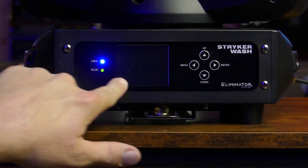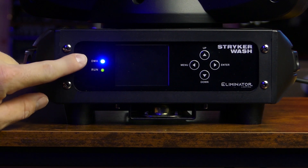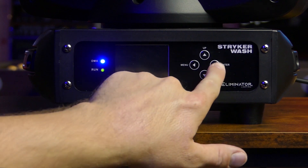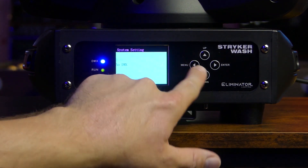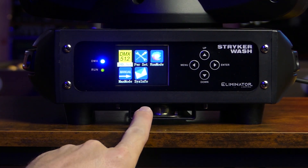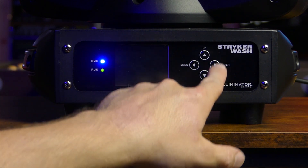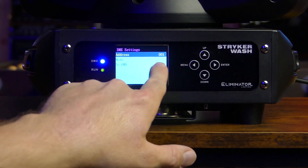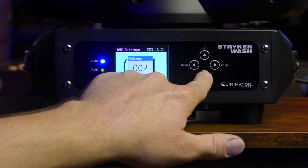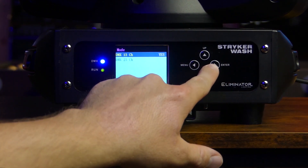Here is that full-color LCD menu. In addition to the screen and the four buttons off to the right, we do have lights to show us that we have DMX signal and that the light is currently running. To access the menu, you just hit one of the arrow buttons — left is menu, right is enter, and then up and down to move between the different settings. The display is super clear and bright; you can see it in dark environments and it automatically dims after a few seconds. If we hit enter on DMX, you can see we can choose our DMX address number right here. Just choose what you want and hit enter again. You can choose what mode we're in — I'm in the 13 channel currently.